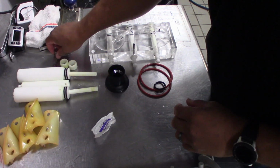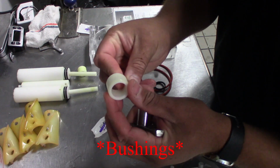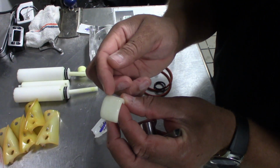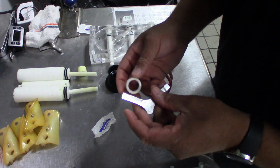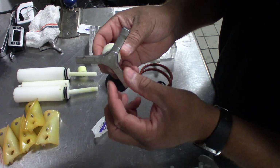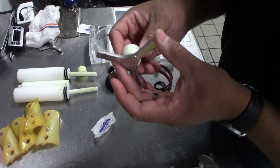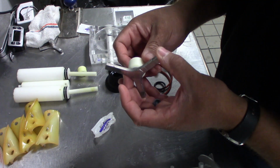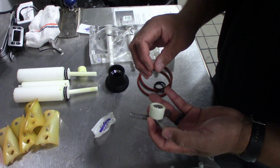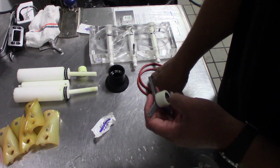The one thing I did almost forget is on our stars, we're going to want to make sure that we're putting lube on our gaskets as well. These have to spin freely, and if they don't get lubed, you're going to start getting really bad ridges along the sides here, and that's not healthy for it at all. These are very important. When your stars wear down, this is what holds your auger assembly within the barrel properly. When this all starts to wear down, it makes an oblong formation, and when it does that, it scars the inside of your barrel. Not healthy whatsoever, not good for the machine. And over time, if it wears that down too far and scars that too much on the inside, that machine has to be replaced.